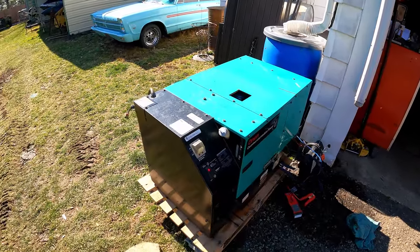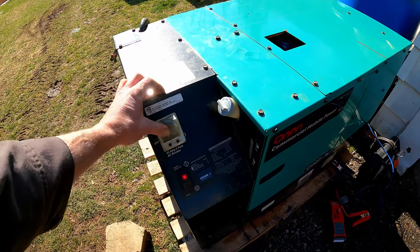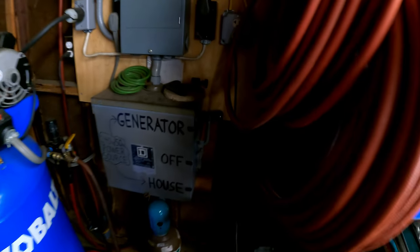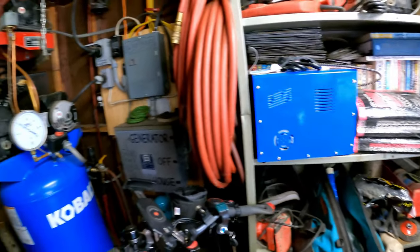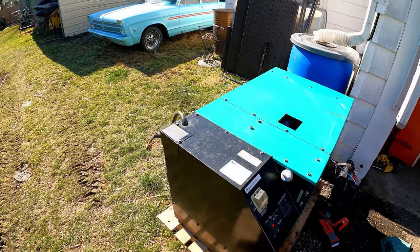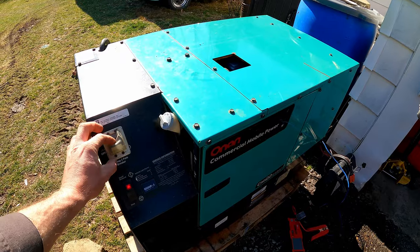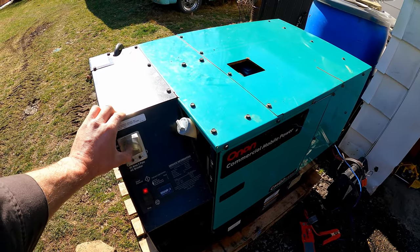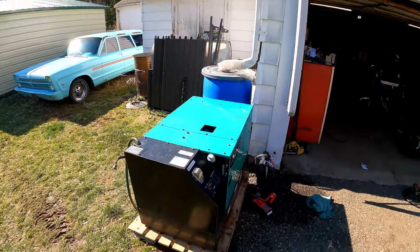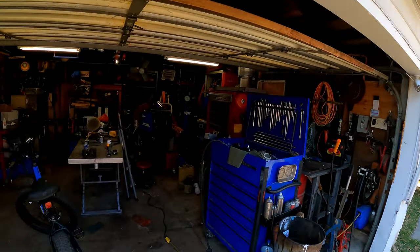This thing, you can't smell it even when it's under load. So let's go put a load on it — let it warm up for a second. Just put the switch on, grab that switch-over and now we're on generator power. I can put a 6,000 watt load with this heater — put that on high. Listen to that at 6,000 watts: still whisper quiet, no smoke. We'll turn this off and here goes the 6,000 watts. Barely noticed any difference. That is only a resistive load, but I was running an air compressor with this the other day and it can even take those really strong surges, just like the MEP 803A.